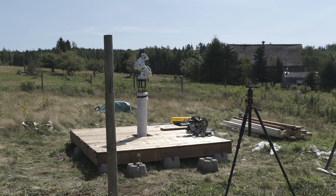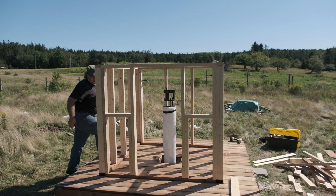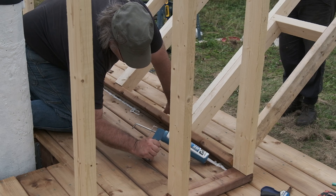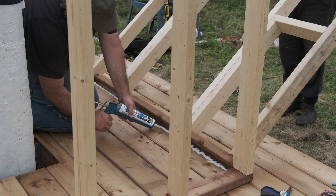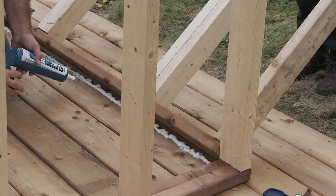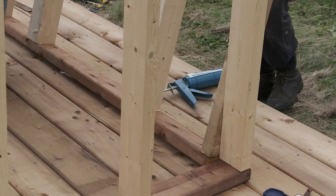With this good weather finally here, it's time to pick up where we left off and start getting those walls up. That begins by taking those frames that I assembled last week before the storm came, and using a few 6-inch wood clamps to hold them all together while I get them squared and exactly positioned around the pier. Then we unclamped one side at a time and ran some DAP 230, a water seal, around the base of the frame to prevent rain and melt water from working its way into the observatory. When the time comes, I'll seal off the inner decking inside the walls to minimize the flow of humidity into the observatory. Summer air in Nova Scotia can be incredibly humid, and controlling the flow of humidity is very important in keeping the equipment operating and not rusting.